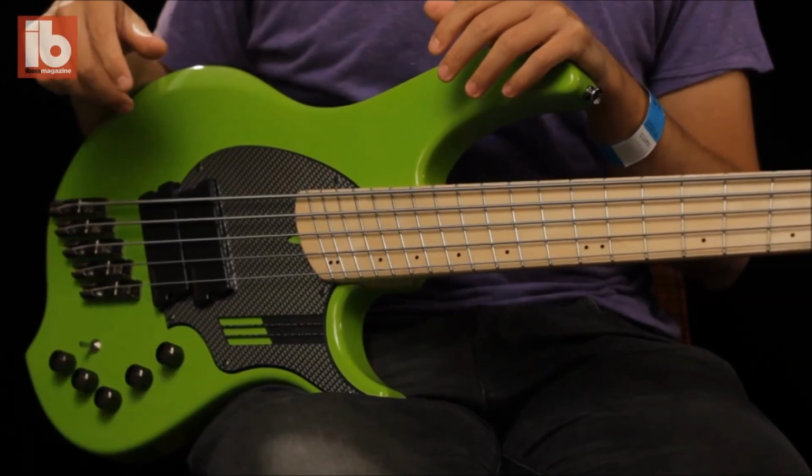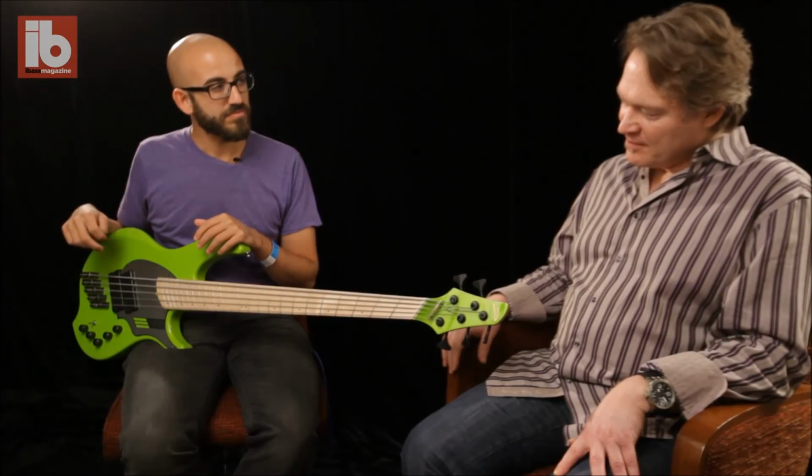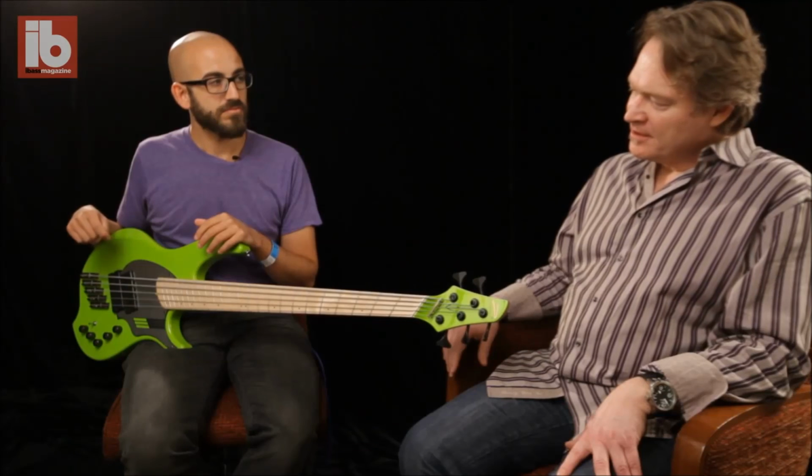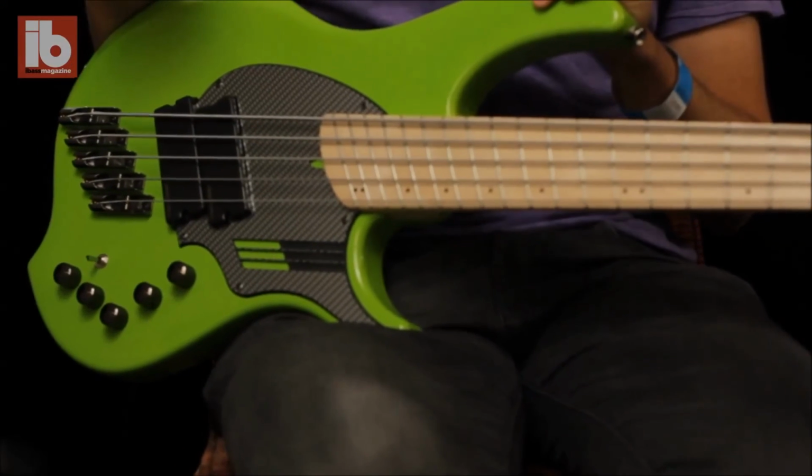My concern, and we went with carbon print instead of carbon fiber for a couple of reasons. One was that I've worked with carbon fiber before and we'll continue to work with it, but machining it, I think, is quite dangerous for people's health, and I didn't want to see that become a factor. Also, with the strakes that cut through it, people are going to be rubbing their knuckles on that. I've had carbon fiber slivers before, and they're one of the worst things. They don't fester and pop out. They just stay in your body forever. So we went with a print, and I really like the look.